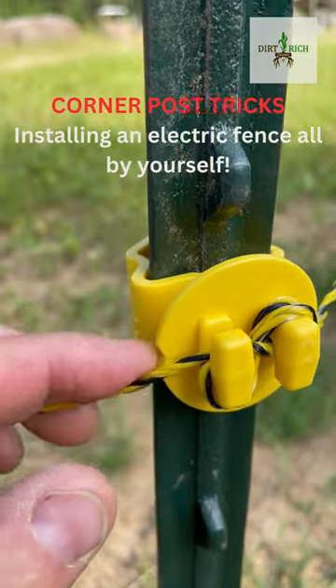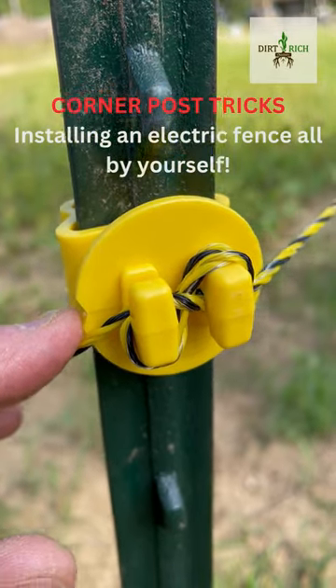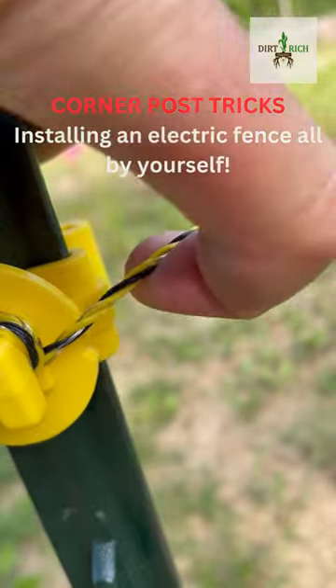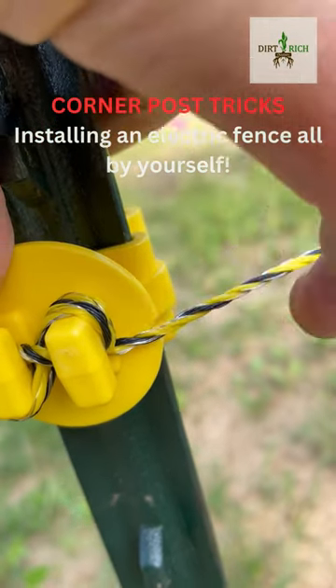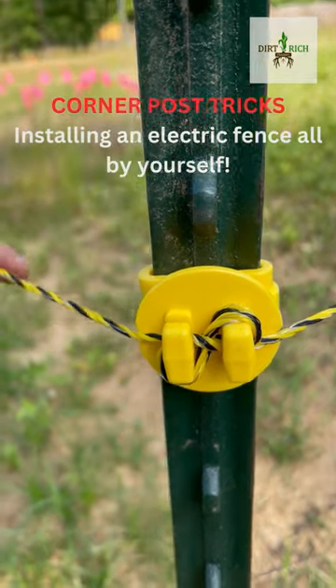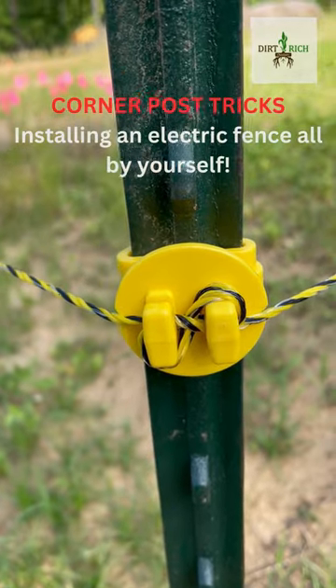The other thing is — I cut with a pocket knife — I take here and I cut a little notch out right in the center of that connector, and I do that on both sides. What that does is if something like a deer actually hits this fence, it keeps that wire from sliding up and down on there, just kind of keeps it in the center. I found that useful in the past.